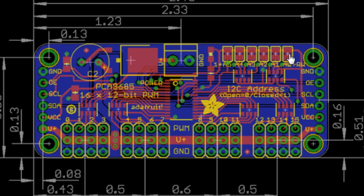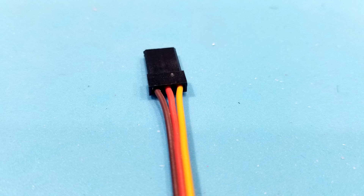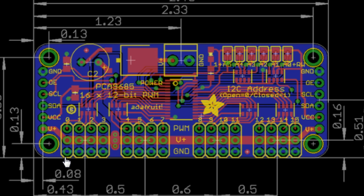This is the 3-pin plug: the center pin is your power, the PWM pins are right here, and then these pins are your ground. With the servo you just plug it in and you're all set. This board is addressed zero, and the connectors are numbered zero through fifteen. So if you wanted to put four servos on here — one here, one here, one here, one here — just to keep the plugs separated, you would use channels 0, 4, 8, and 12 in your sketch.